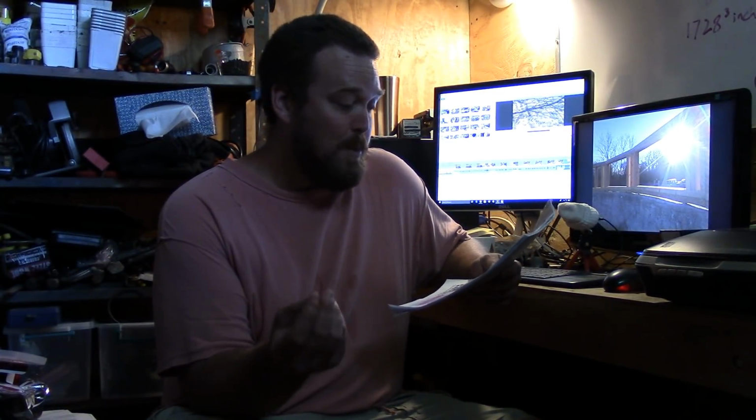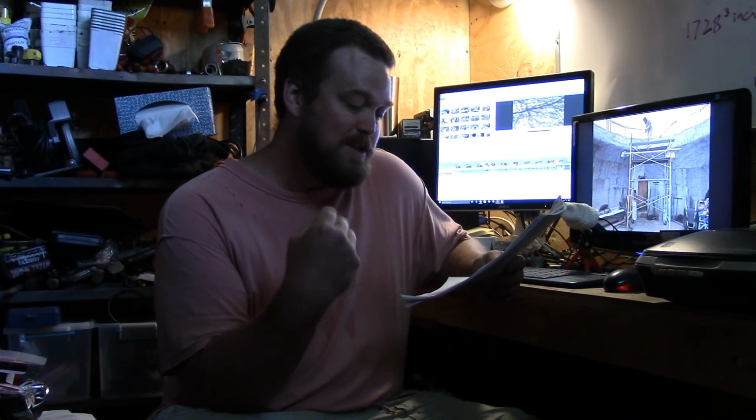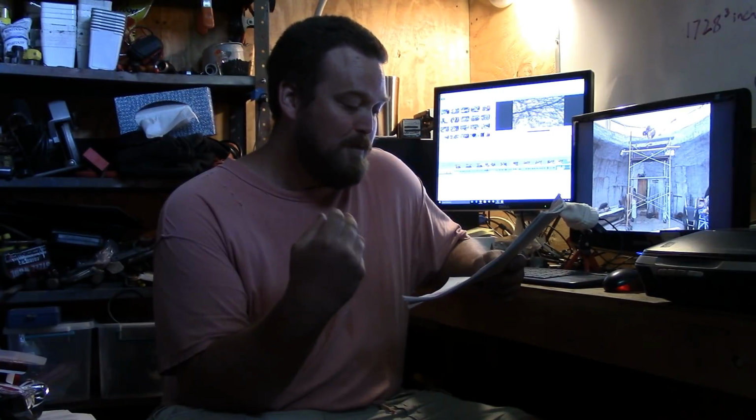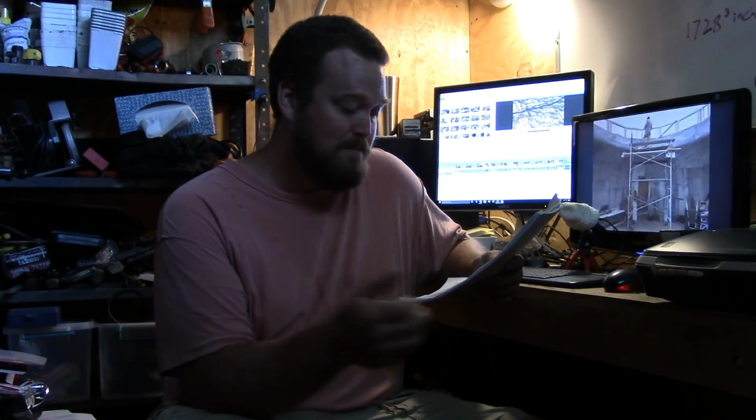So I've been doing some reading on sand and what the desirable properties and what the undesirable properties are. So this, I downloaded off the internet, is chapter 5 of the Design and Control of Concrete Mixtures. And chapter 5 is titled Aggregates for Concrete. So I'm gonna read some highlights. Some variation in the type, quality, cleanliness, grading, moisture content, and other properties is expected. Aggregates must conform to a certain standard for optimum engineering use. They must be clean, hard, strong, durable particles, free of absorbed chemicals, coatings of clay, and other fine materials in amounts that could affect hydration and bond of the cement paste.